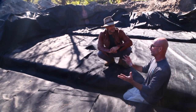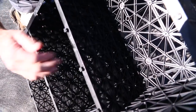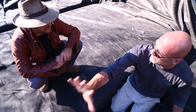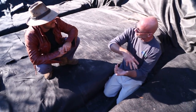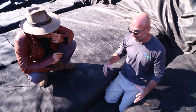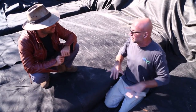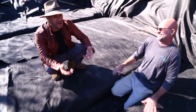The way those aqua blocks are designed, it's called a matrix — they have webbing and internal panels developed to break down laminar flow. Laminar flow is when you have a mass volume of water just moving. By having all those little matrix features, when the water comes out it creates micro eddies and turbulence inside, which mixes the water and further allows the sedimentation process to occur. That space also becomes home to different microorganisms — nematodes, tardigrades, rotifers. Tardigrades can live in space. I'm a tardigrade farmer. The water bear — moss piglets.